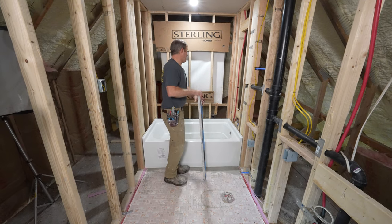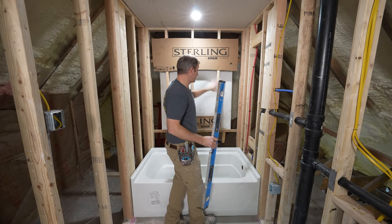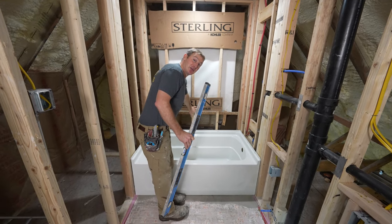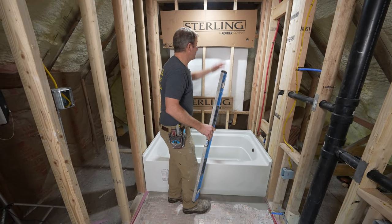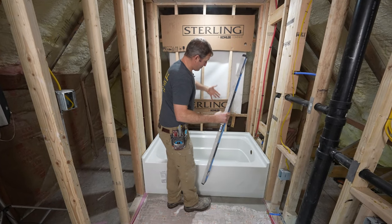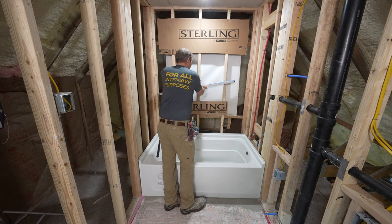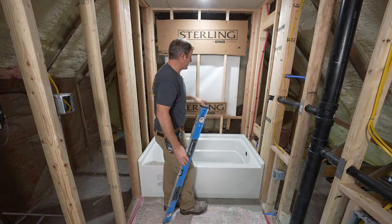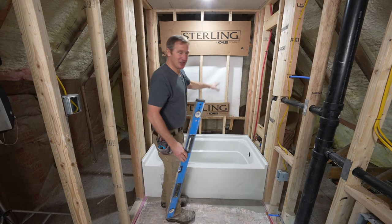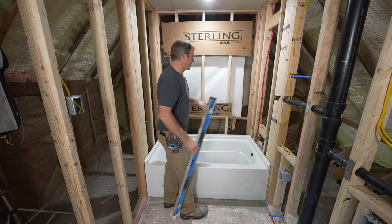A couple other things to evaluate before we take this tub out: how plumb your walls are, because that's going to be really important for the walls to sit correctly, especially the back wall. If it's tilted in too much, it can be very problematic when you have the tub sucked all the way to the back. You could shim the entire tub out if you don't want to address the framing. But I would really recommend making sure not only are all your studs in a line, but that they're plumb. When you do ceramic tub surrounds you can fudge a lot of things with extra thinset, but with a tub surround kit, if the back wall is not plumb it makes all the side panels not sit correctly against the tub.